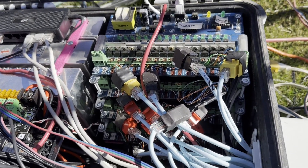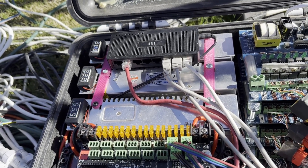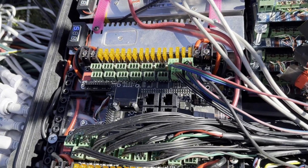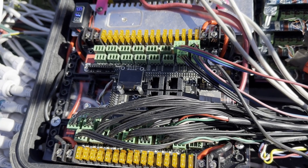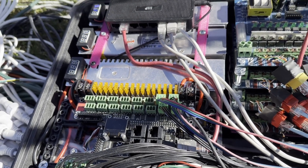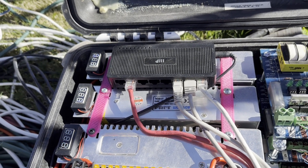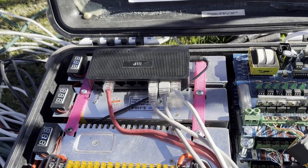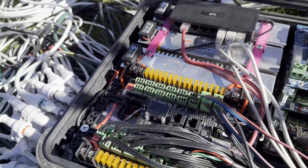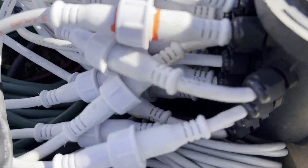On this side of the box I've got three five-volt power supplies with little LEDs so I can check voltage output. There's a 32-port CULP board that runs the mega tree and the front yard show. I've got room for expansion, and there's a little Monoprice five-volt eight-port gigabit switch — great because it works off five volts, so I can plug it right into the five-volt supply without any extra dongle. All my pass-throughs have cable glands on the sides for water retention.